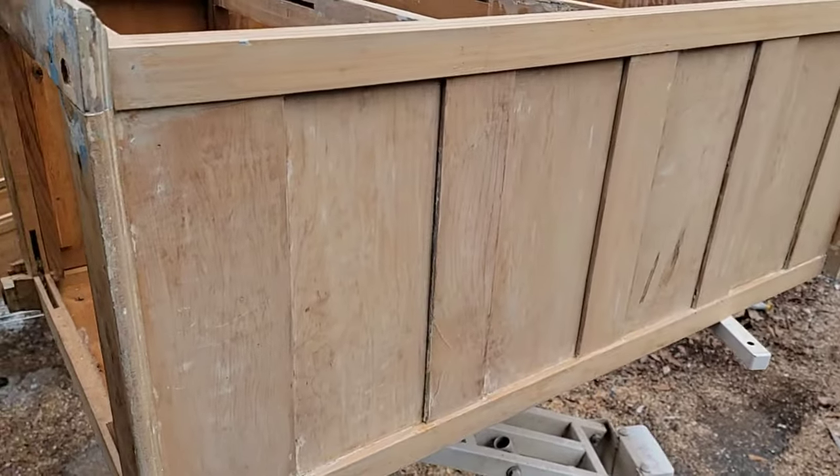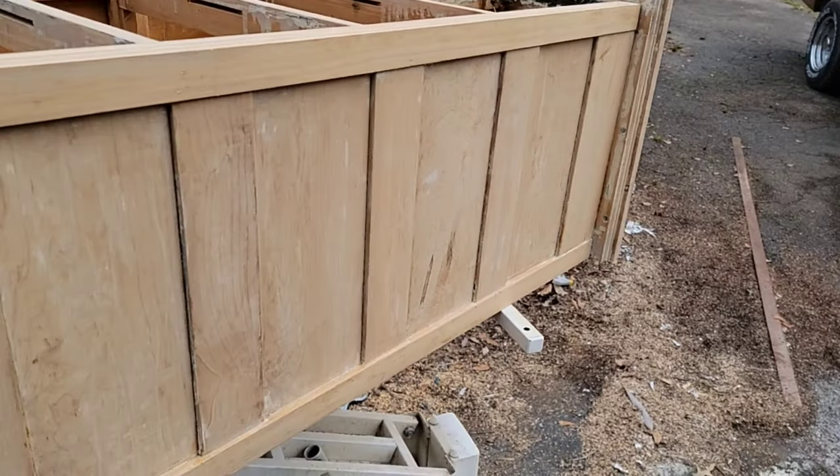But that's why, because there were contaminants, there was dirt, there was a lot of nasty stuff left on that dresser that could have interfered with the paint and the clear coat. So that's why we cleaned it. It took maybe 25 minutes to wipe down the whole thing, clean it all. We're gonna let it all dry real good, which it's not super soaked. It's not like soaking wet. So that's another key point. But when that all dries, we'll be ready to spray. So hopefully the weather holds out so we can spray it, because I spray outside. So all right, let's go cut all our drawer box pieces.